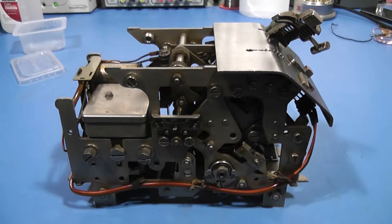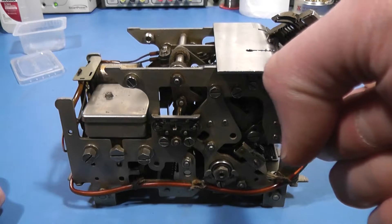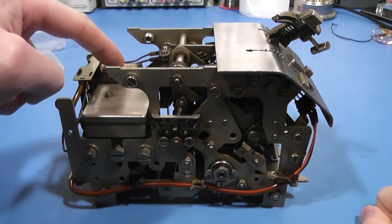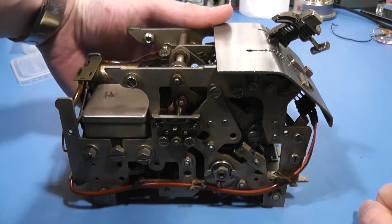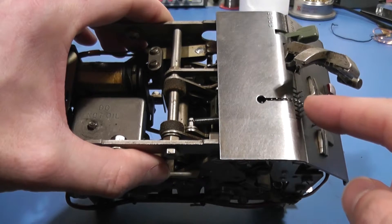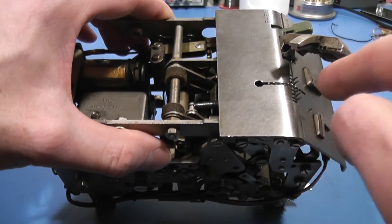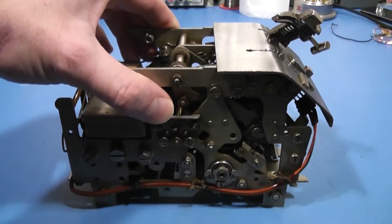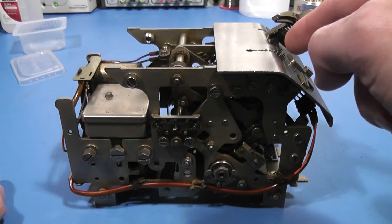Let's look at the operation of the LXD from the outside in. What happens when this device is triggered? It's triggered electrically by the operating switch being in the run position and the tape-out indicator being depressed, and that causes this selector magnet over here to pull an armature that trips the clutch. When that clutch is tripped, these pins protrude from the front. As I mentioned, the springs behind them are relatively weak, so they're actually stopped by the paper and prevented from extending where there is no hole.